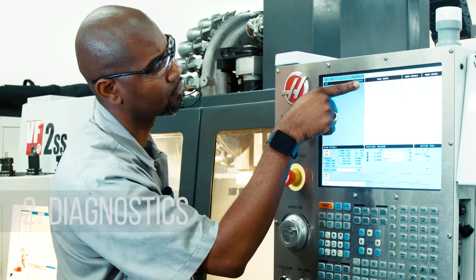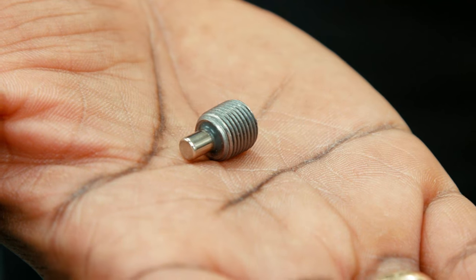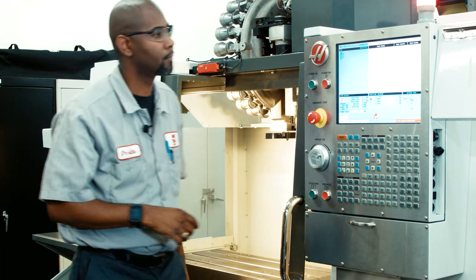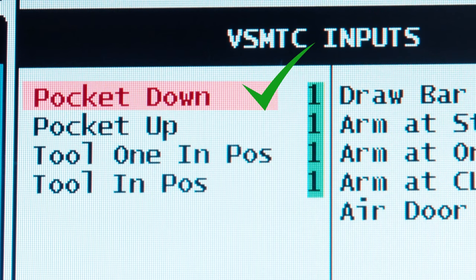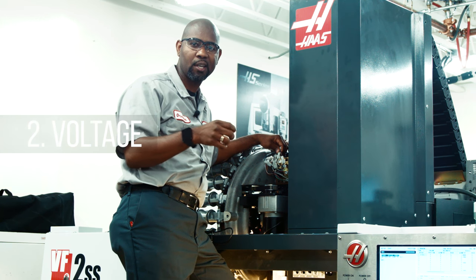Go to the diagnostic page and find the status bit for the sensor you're testing. Then take a small magnet and place it on the proximity sensor's face, and check the bit to see if it changes state. The sensor should change from 0 to 1 or 1 to 0, and stay there when that position has been reached. The readout should stay steady and not flicker. Now we want to verify the voltage at the sensor, especially if the diagnostic bit is flickering.